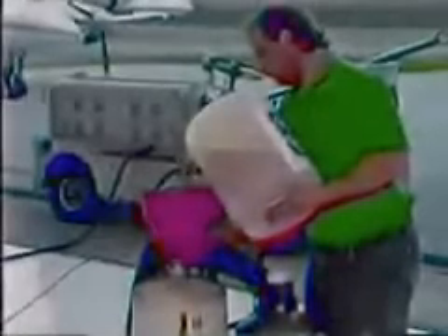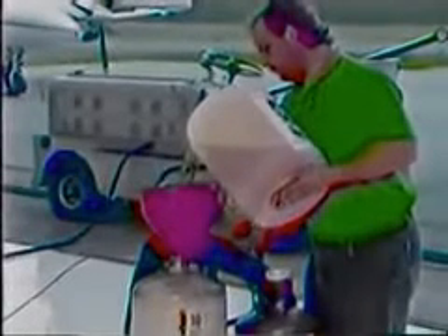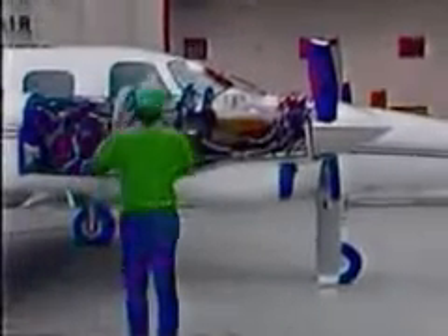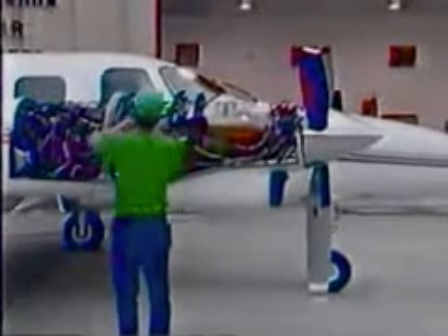The running wash: fill the pressure tank with five gallons of RMC. Each engine requires two and a half gallons for proper use. Install the wash wand on the inlet screen for running wash. Secure the wand with clip, tape, etc.